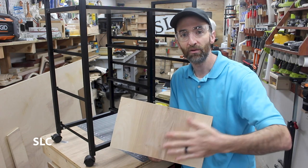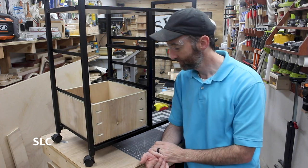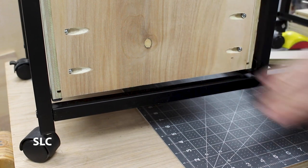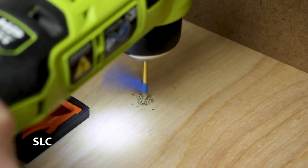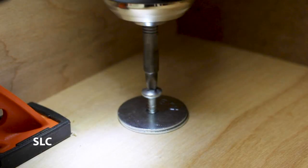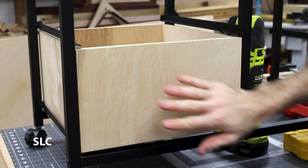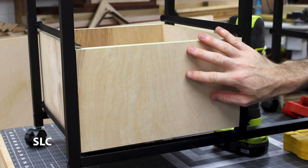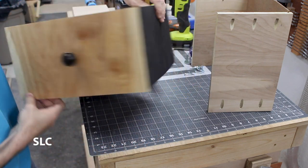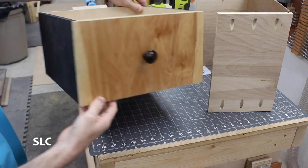You want to make sure the really nice sides face outward so when the drawer gets pulled out that's what you see. That's a simple way to make a drawer. I've also noticed the current slides on this frame are not exactly straight, so no matter what, the front is going to be a little bit off — we'll just do our best. To attach the false front I'm going to use two one-inch screws, but to keep it from protruding I'm going to use a couple of large washers. I'm going to paint this a satin black so it matches the rest of the frame and put a nice little knob right in the middle. I tested a satin black on the sides and a polyurethane on the front, and I think that really just pops. I added a knob and I'm going to do this on the rest of the drawers.